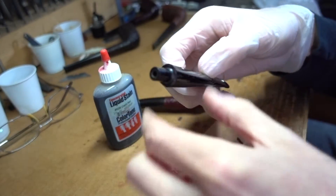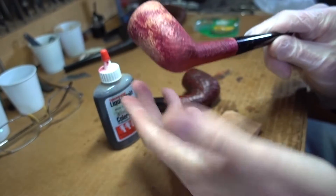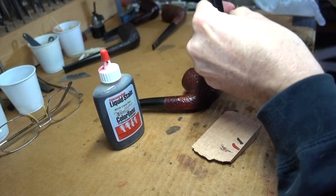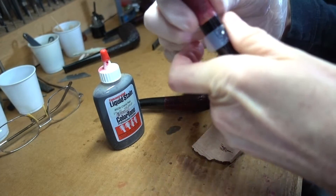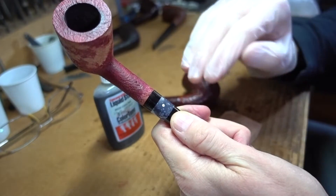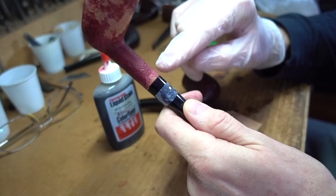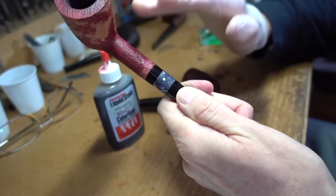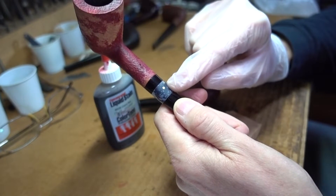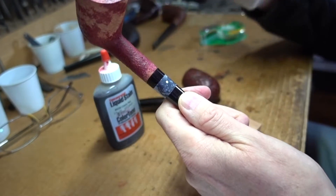Another thing before we begin: it's normal to use the stem as a handle so you can manipulate the stummel without getting your hand covered with stain. If you've got a logo of some kind and it's a finished stem, your best bet is to cover anything like a stamp or inlay. Because if that gets stain on it, you're back to sanding and having to redo work unnecessarily. You will get some stain on the black part of the stem, and even wiping it off with alcohol and a tissue — if you drag just once across pure white, you're going to get a pink dot. Why do it at all if throwing some tape on there saves you the effort?